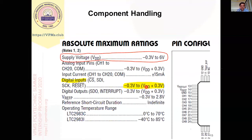Before understanding what electrical overstress is, please take a closer look at our data sheets. Every electronic IC is supported by a technical data sheet, which mentions many technical parameters. Normally, in every technical data sheet, there is a chapter or paragraph that mentions the absolute maximum rating. If you take a closer look at this absolute maximum rating, there is something called the supply voltage range. For this particular IC, which is basically an A-to-D converter, the supply voltage range is from -0.3V to 6V. If any voltage beyond this range is applied to this component, it will damage that component.